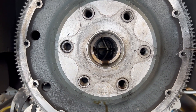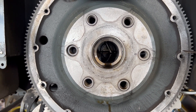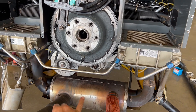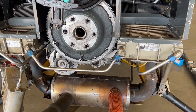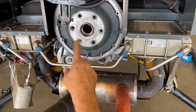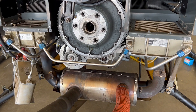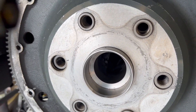That tube uses oil pressure to change the pitch of a constant speed prop on this aircraft. Obviously it has no constant speed prop, so they put the plug in place, but the crankshaft can be used in different applications. On the Lycoming O-320s there was an AD that came out where you had to pull that plug out and look inside the crankshaft for corrosion. On this engine there's not much sludge and no corrosion because the oil flows through there. On some other applications the oil didn't flow inside the crankshaft, so that space was susceptible to condensation and would start corrosion.